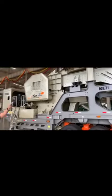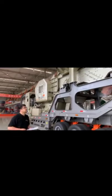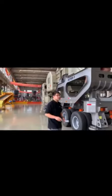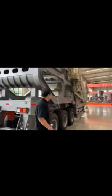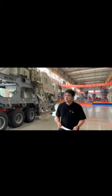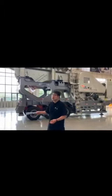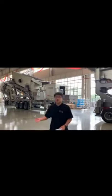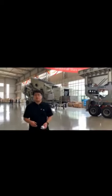The hopper of this machine is detachable, so if you want to change to another machine configuration, you just detach it. Our mobile crusher can be equipped with eight series of machines and 72 products. It can be equipped with a jaw crusher, impact crusher, or cone crusher. If at one project you need a cone crusher with a vibrating screen and feeders, and your next project needs a different cone crusher, you just order a new one — your screen and feeders remain unchanged.